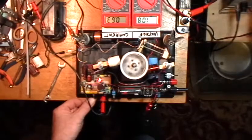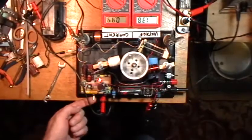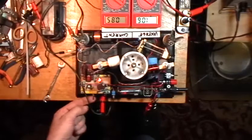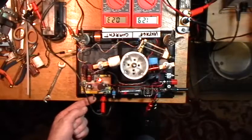All right, let's do it again the other way. My timing is not perfectly symmetrical, which is why it runs better going in the opposite direction with opposite coil polarity. This actually turns the motor into an attractive pulse motor when I reverse the polarity to the coils.